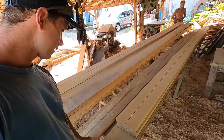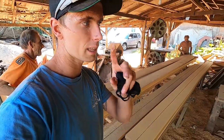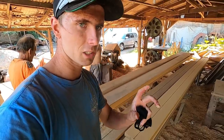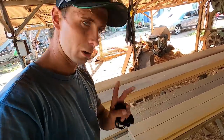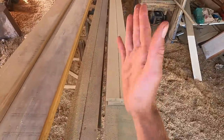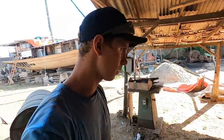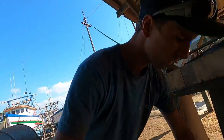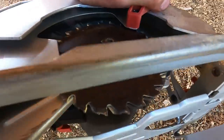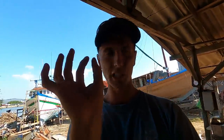We previously cut the grooves inside the deck planks with the circular saw using a double seven-and-a-quarter-inch blade. But as the blades were quite long and big, they wobbled and created some irregularity in the grooves. So what's happening now is we're going over them again with two smaller blades, which are less likely to wobble and will cut a much nicer groove through the middle.